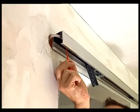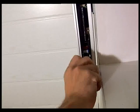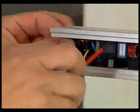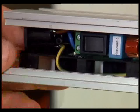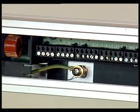Our mounting example is equipped with permanent power supply. Following lead L1 and N have been cut to length, and the insulation has been removed. Connect the leads to the connection terminals of the CS80-magneo. Lay the protective earth through the control unit housing and connect it to the respective terminal. The protective earth is indispensable.